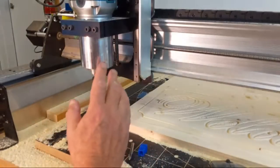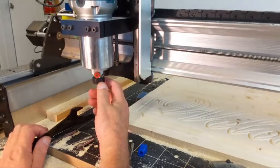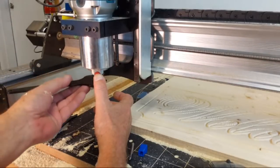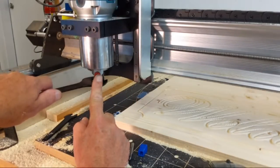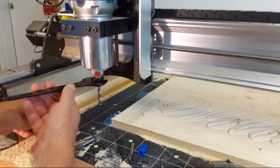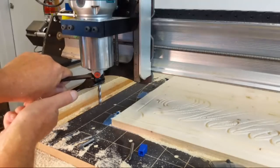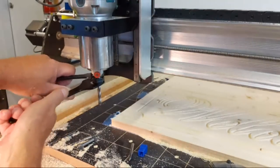I don't know if you've seen it before. Sometimes people have the cracked housings. And the reason that's happening is they're using the red pin to hold the shaft, and then they'll come in with the big wrench and they'll crank down really hard on it. Makita says it's okay to use that pin to tighten your stuff. I'm a huge opponent of it because you can start to stress the housing and you'll start to stress out the aluminum in here where the bearing's at. So I never, ever use that pin to tighten all the rest of the way. When you tighten down, you don't have to torque it down. That's what most people are doing when they're breaking it. They're using this pin and they're pulling really hard, thinking they got to really squeeze. And you don't have to do that. It's just past the snug is all you need.